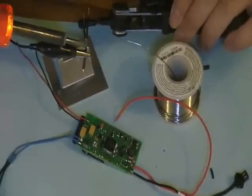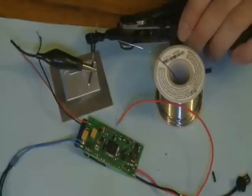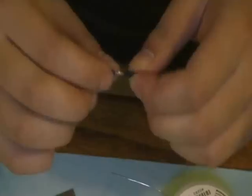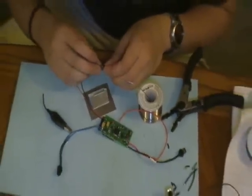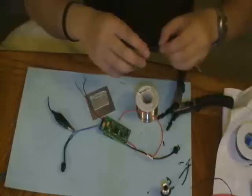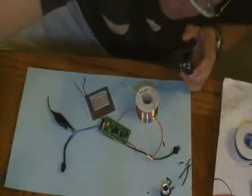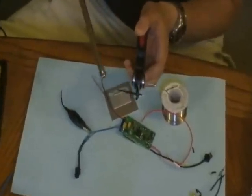However, you don't want to have a whole bunch of wires sitting on one pad on the board. If you want to do anything, you want to make some kind of bridge or Y connection just like he's doing here. You could have it split into several wires — three or four or whatever. Sometimes you'll need that when you have stuff like a motor, indicator LEDs, your batteries, and your switches. You're going to get a lot of components that need negative leads.